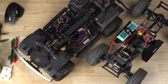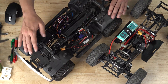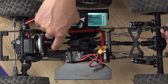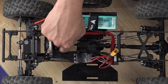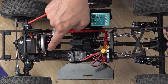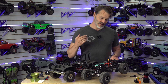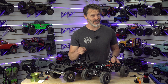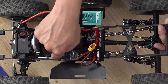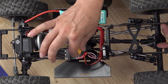Here are two different rigs. We've got this competition rig from Vanquish and we have this regular TRX4 with a two-speed. On this rig, we've got this neat little 540M TeamSpec in here and it is hard-soldered to our Crawlmaster B3. Being a TeamSpec, this motor actually has pretty thin wires and it really doesn't have heat problems because it is a low KV. With lower KV motors, you can get away with thinner wires on these three-phase wires in particular. But the wires coming off the ESC for the battery side are thicker.